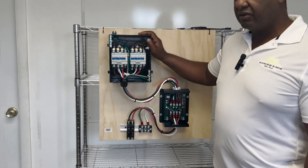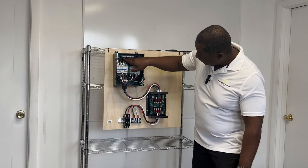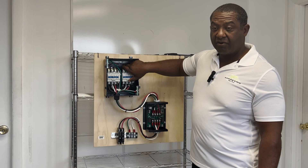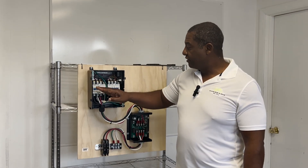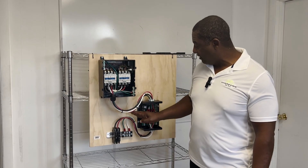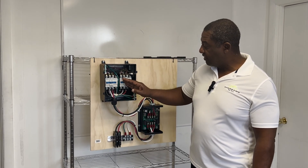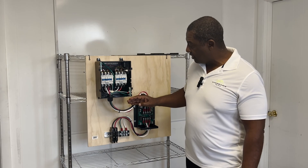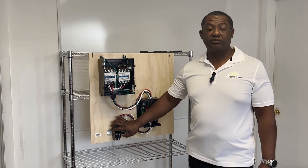This is a typical transfer switch, and at the very top it tells you this is your shore power connection side, and this is your generator power input side — the logic does the rest. This is primary, so if there's power here, the power will come through this, through here, and then back out to the load. When an air conditioner turns on, our unit will soft start it and limit it. If it's a generator — same situation: generator is running, this side is open, this side is closed. Power comes through this jumper back to this side, and then back out here through our unit and distributes through your camper.